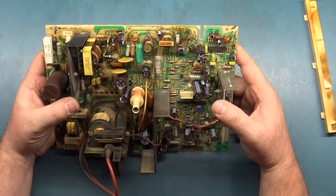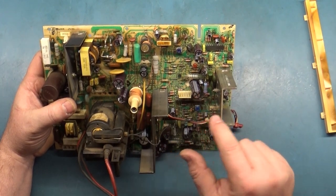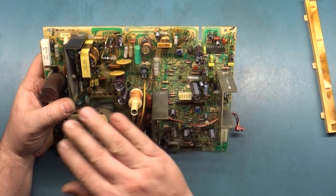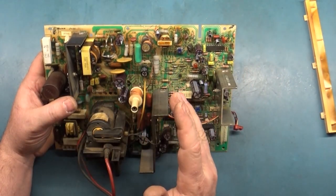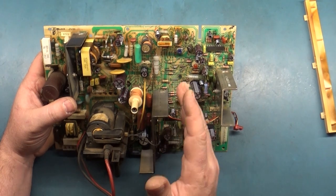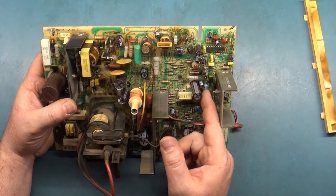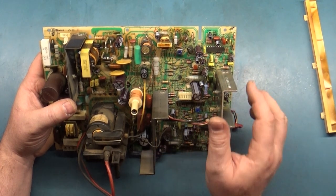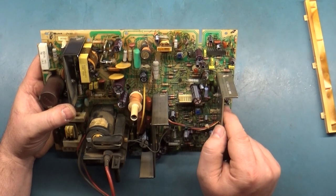But I'm fairly confident that it's this cap right here, the 63 volt 33, not being replaced, but the other ones were. All the caps that were replaced were the correct rating, so it wasn't an issue of an incorrect rating. I think it was probably because that one cap that wasn't changed might be slightly out of tolerance. And it's absolutely in circuit with the vertical IC.